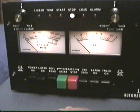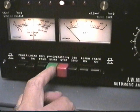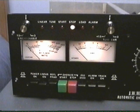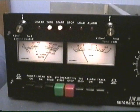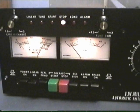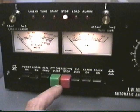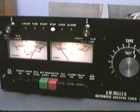Let me show you the tune button here. The way you tune this is you crank in the carrier — and that didn't work. Now what you do is inject the carrier and hit the start button; it'll set off to do its tuning. In this case it went pretty quick — doesn't always go that way. I just changed bands, went to 20, and it tuned pretty quick.